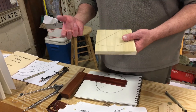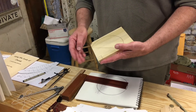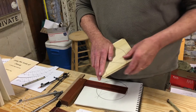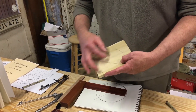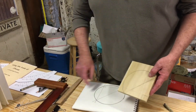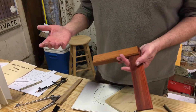You can also use this master to make a 45-degree miter gauge. Lay the miter gauge on here, scribe a line, flip it, scribe another line — if they're parallel it's 45 degrees; if not, you can tune it. So by knowing this geometry you can make the master, and from the master you can make a miter gauge.